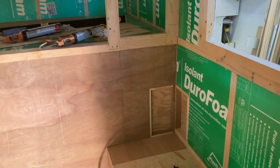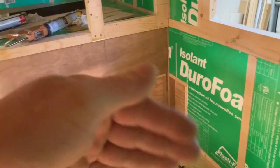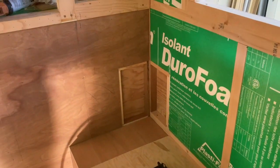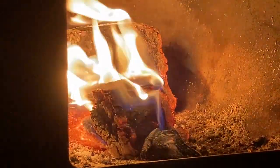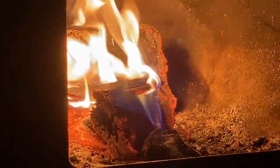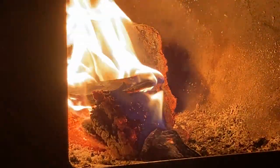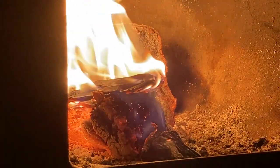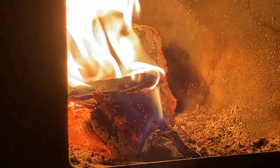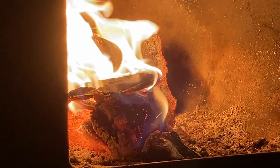Our paneling is in, including our little patches. Like I said, under the sink counter and there's going to be a back here with cushions — it's all going to be covered. I think I'm going to wrap this video up here. Basically: fit your pieces, mark your stud locations, put your PL on your Styrofoam and on the actual studs, set it in place, and staple it home. I have a little bit more interior paneling for my next video, some of it in the upper bunk area, and then I do have footage I'm editing for the exterior trim, which I'm hoping to get done pretty soon. Thanks a lot for watching.